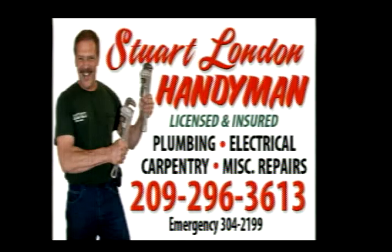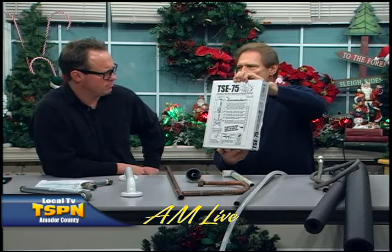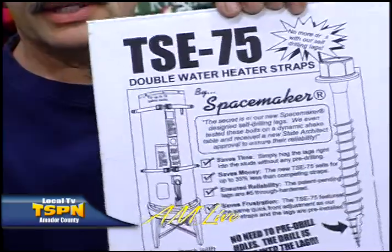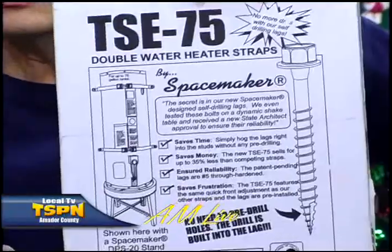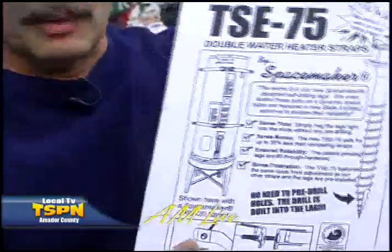While you're looking around the house, look at the water heater. Your water heater, according to code, needs to be strapped — two straps, top third and bottom third. This is a package with steel straps; they also have nylon straps. They all meet code. Plumber's tape, which is that metal tape with all the little holes in it, does not meet code — so not a proper item.